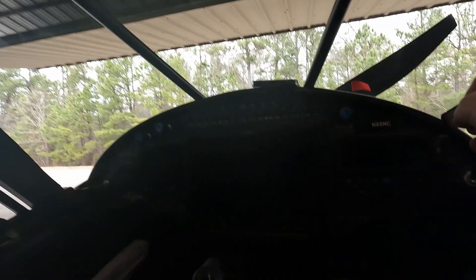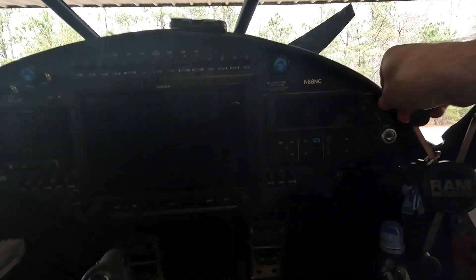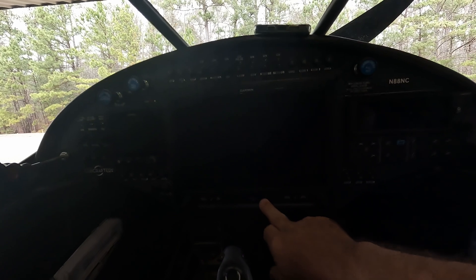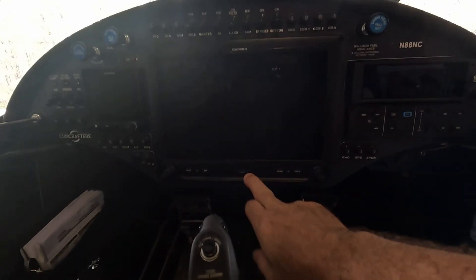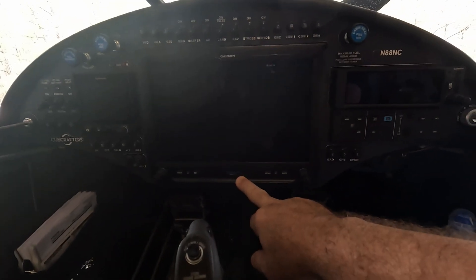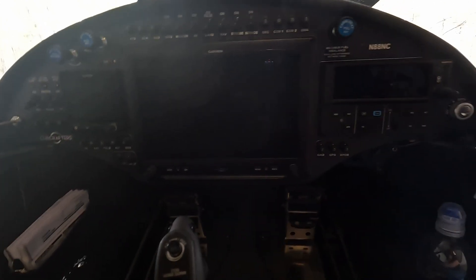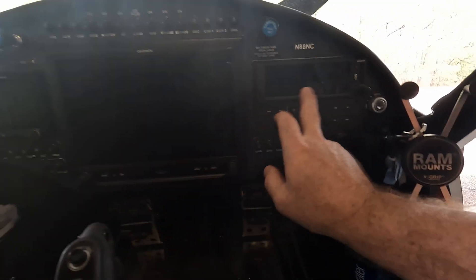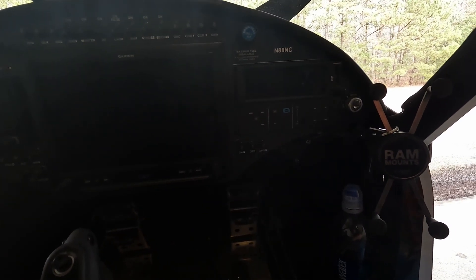What I do is before powering on, I put in the SD cards with the updates. This is just map updates, not firmware updates. I did read online that you can hot swap the SD card and the G3X will pick it up — I actually tried that last time because I had two different SD cards with updates created at separate times. By the way, you get the updates from flygarmin.com — there's a subscription, mine costs around $680 a year for the IFR and VFR package, United States only. The GNC 355 did not like the card being hot swapped — it actually barked at me with a failed SD card load failure or something to that effect.